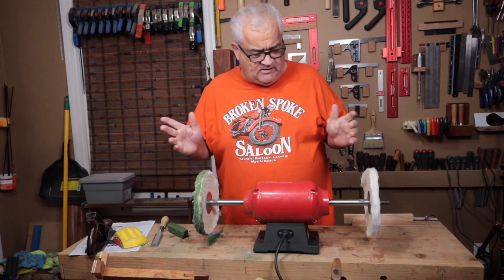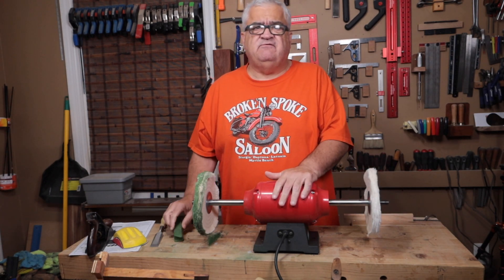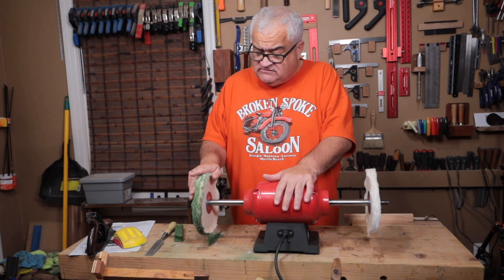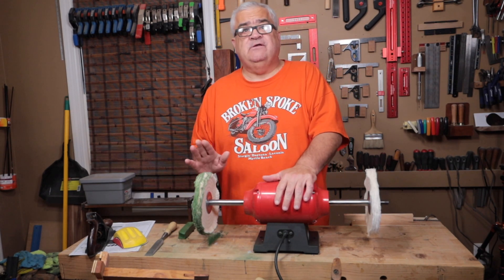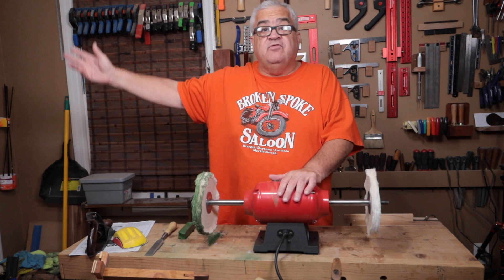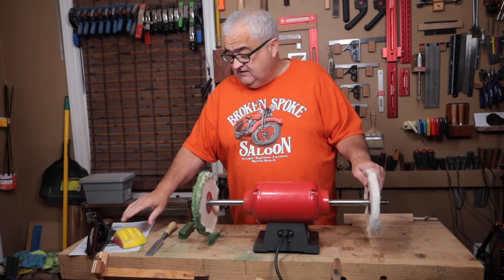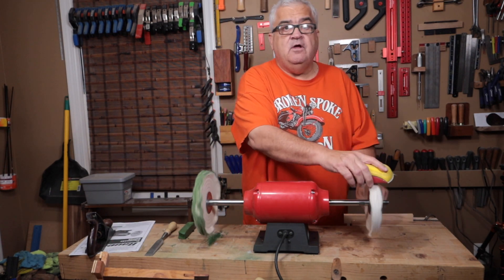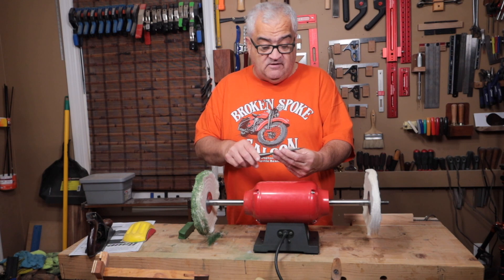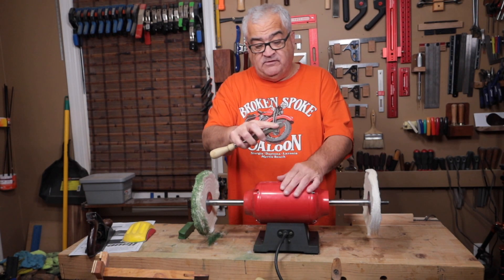It's another day. I omitted a few things in this video because I had some problems with the rouge, so I wanted to explain. What happened was I put some green rouge on the wheel and started using it and it started sending string all over the place. I googled buffing wheels and found that taking sandpaper to the new wheel while it's running will clean up the string — that's what I did. I then showed buffing the back of a chisel very quickly but never actually showed you that it did shine it up a little bit in that area.